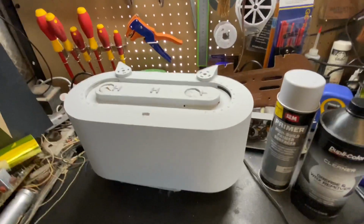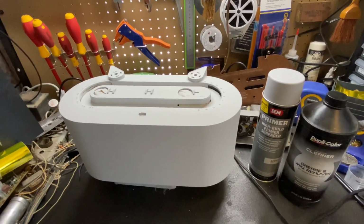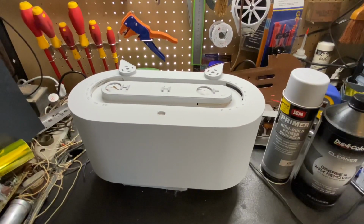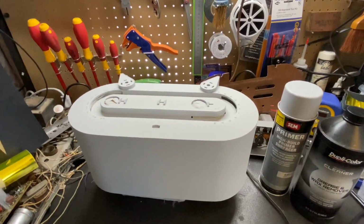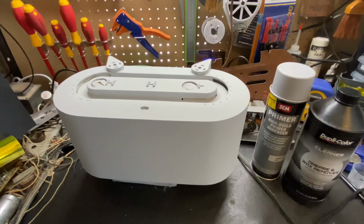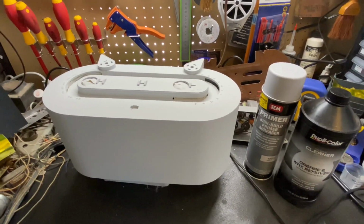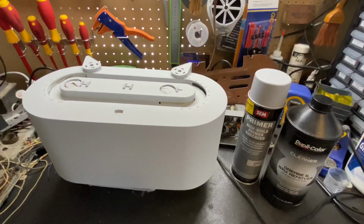Now, the most important thing is you need to wait. Allow this to cure. Don't start working on this and sanding this and painting on it right away. This needs to cure for, I would say, a week. If you're in a hurry, maybe 3 days. But a primer filler is a thick paint, so it really needs a long time. If it's cold weather, at least a week to cure, maybe longer. Bring it inside if you can, if the fumes don't bother you.